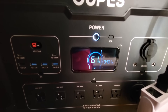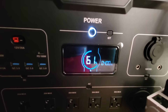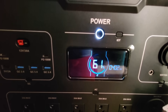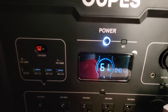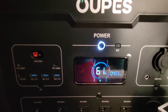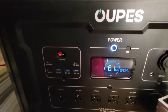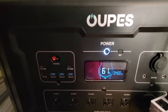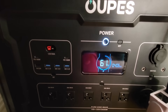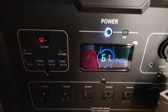That is not too bad at all. Being that the sun is not really in its optimal location right now, we are pulling in easily 400 watts from those six solar panels, which really is not too bad. Right now with the sun not being in the best place, we're pulling in about 65% efficiency, if not a little higher. And you just can't beat that for 55 bucks, I have to say. So I'm going to leave this hooked up and come back in about two or three hours when the sun is right overhead pointing directly at those solar panels, and we'll revisit this and see what it's at when the sun is where it's supposed to be. So far, I'm pretty happy with this setup.